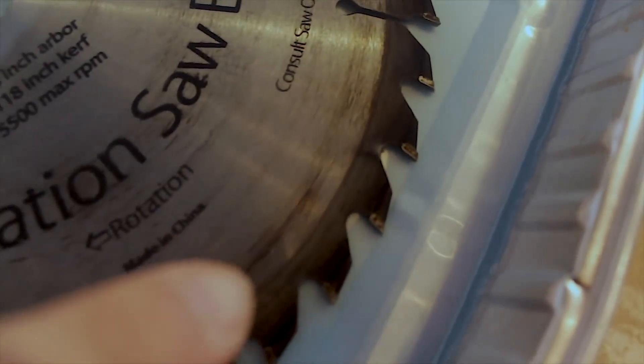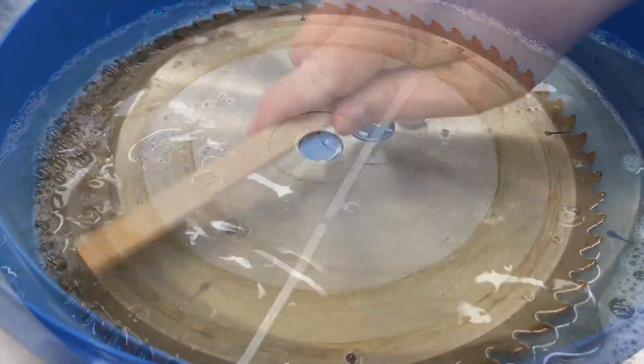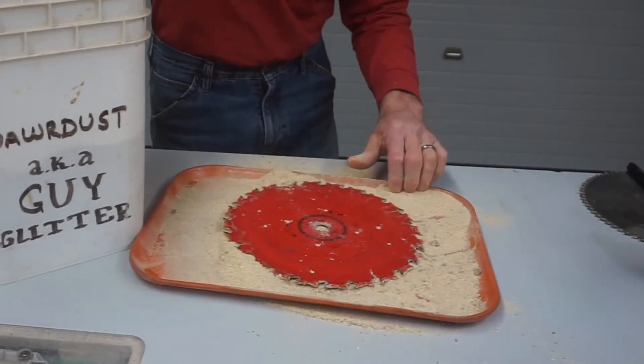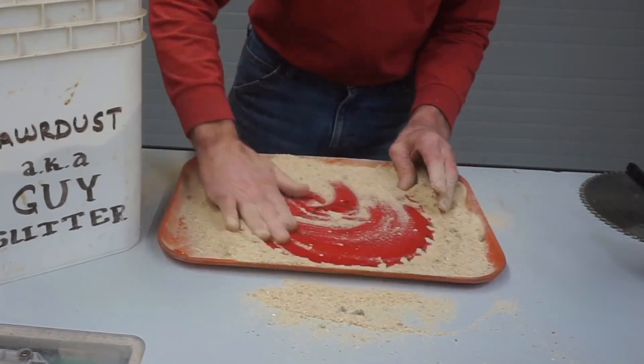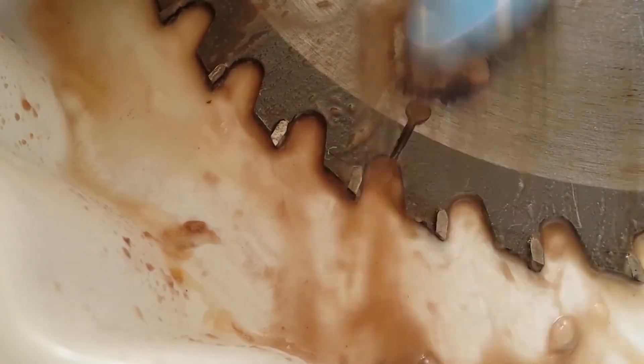Hi, I'm Frank Petiflu from Omega Sonics. Before saw blades can be assessed for repair and sharpening, they must have all the wood pitch removed from them. The long-standing method is to soak the blades overnight in a bath of caustic lye — that's fancy talk for drain cleaner. The blades are then drained, brushed, and wiped to remove any residual pitch residue, then dropped into a sawdust bin to dry out. A very dangerous, slow, labor-intensive, and tedious process indeed.